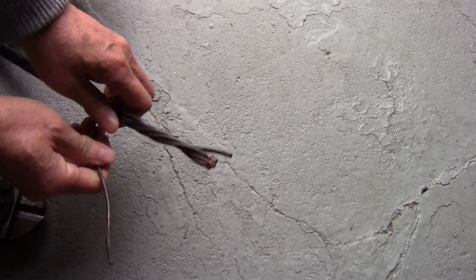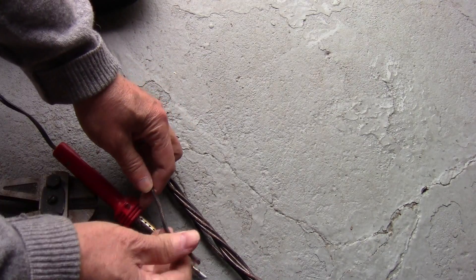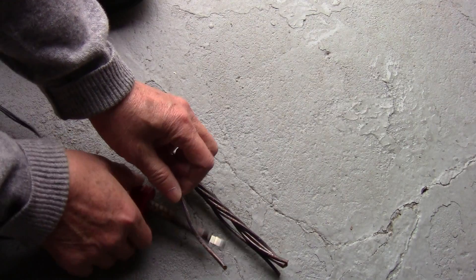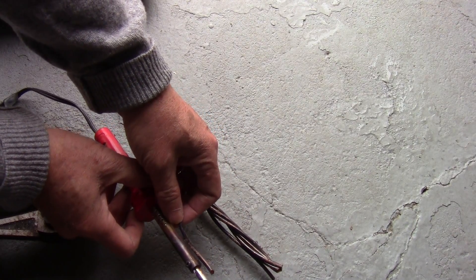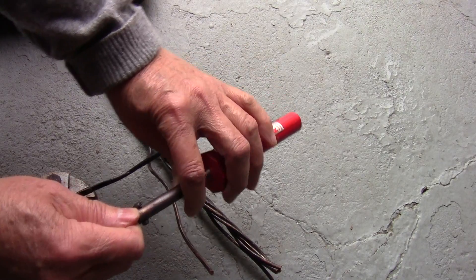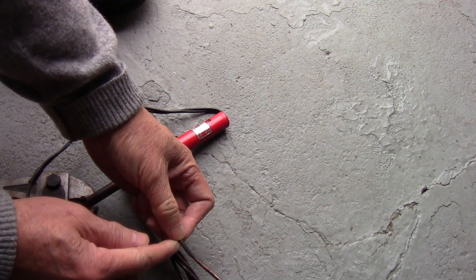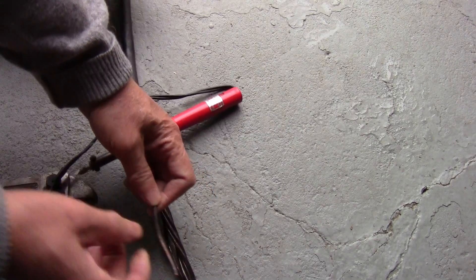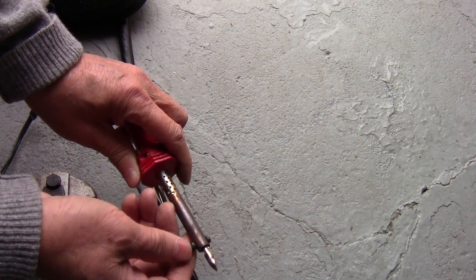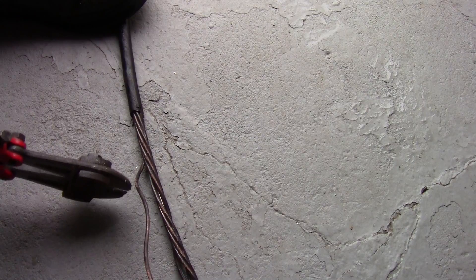Here I have a piece of wire already. The original tip is 4mm in diameter and 77mm in length, so that's what I'm going to aim for. Also, when I was trying to pull the old tip out, it was stuck in there and I couldn't understand why. There was actually a little raised ridge at the back. You really have to yank the thing out — just loosen the screws and yank the whole thing out.